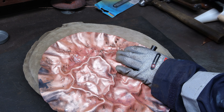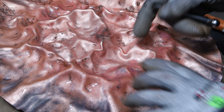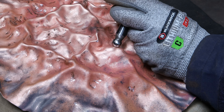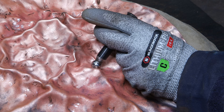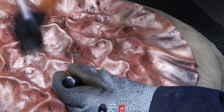In close-up you can see how you can really easily define where a spot needs to be raised — I put my finger on it, flip it so I know exactly where to apply the tool, and use the dapping tool not just in one direction but in different directions to create more interesting ridges. The same way when you turn it around, I go around with the dapping tool from different angles to carefully shape the ridges.